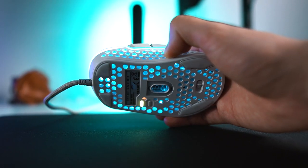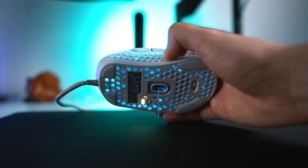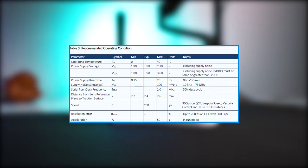An important thing with sensor precision is the distance from surface to lens. There is actually a specified distance on how far the sensor should be from the surface that you want it to track on. Let's take a quick look at one public datasheet from Pixart Sensors. If you happen to be interested, the link to the full datasheet is in the description. But I'm gonna show you this table of recommended operation conditions.